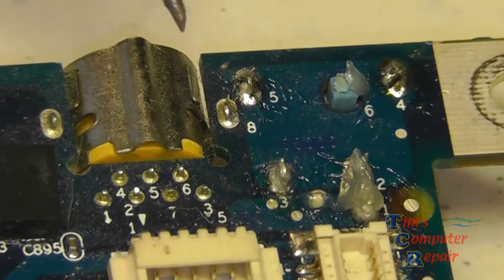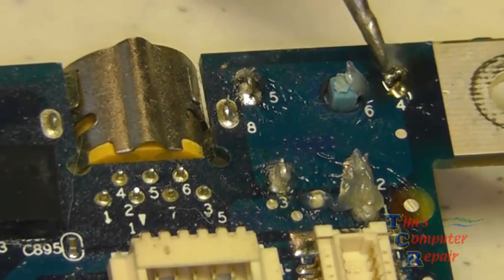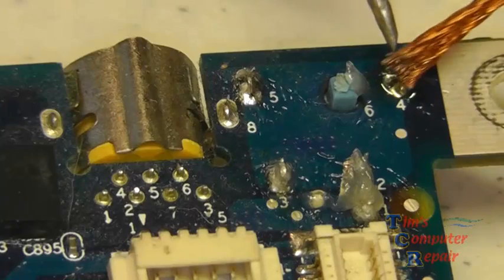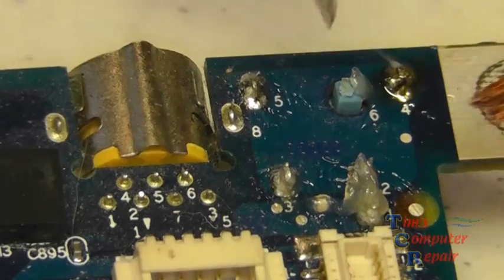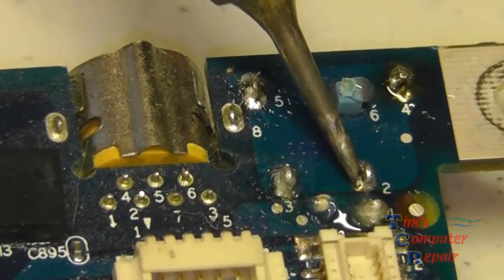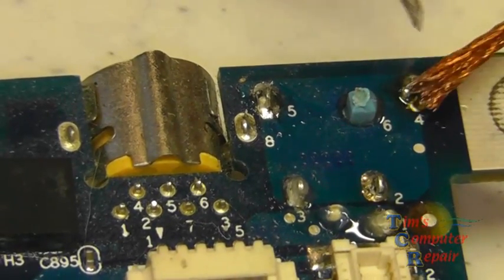In this particular case, I'm going to start off by using a solder wick to thin out some of the solder around these joints — I think it's going to help when I use my hot air since there'll be a little less solder to have to melt. So I applied some flux to all of my joints here. Flux is really great for helping solder melt, and I just go around with my solder wick to sop up as much of the excess solder as I can, to aid me when I go to heat this up with the heat gun. My thinking is: less solder to heat up means less time applying heat to remove this power jack.